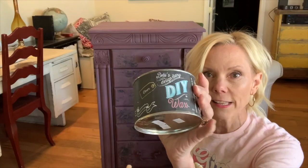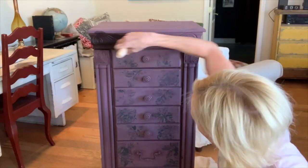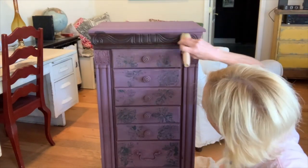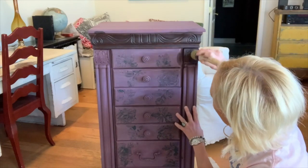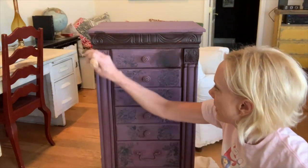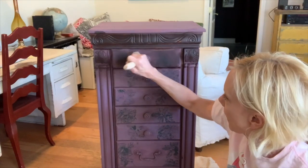I've got DIY clear wax — no smell, actually it smells really good, all natural. I just put a little tiny bit on the end of my brush and start at one end, working my way over. You'll notice it's going to look wet, and in some areas it's going to look really translucent like I'm taking the paint off, but what's really happening is it's just penetrating deep into the paint. Once it dries it's going to dry to a hazy finish, a little darker than what it already is, and then I know it's time to buff it. I go in circles — I just happen to like the way it looks with soft circles.